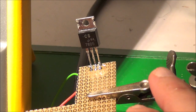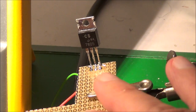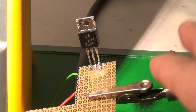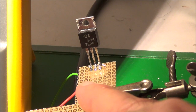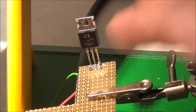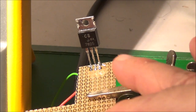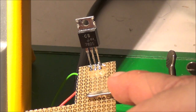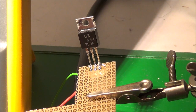If you're not getting any input voltage, you could take a power supply that meets the requirements of the circuit and hook that up instead of the unit's power supply, and then see if you get good voltage coming out. Also, if you have the voltage regulator disconnected, you could directly use the power supply to power the circuit and see if it acts normal — that's basically option two.